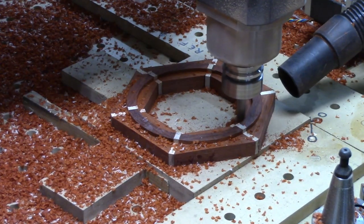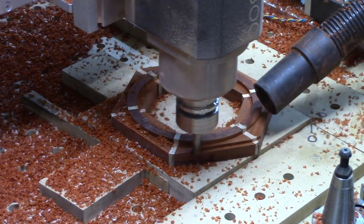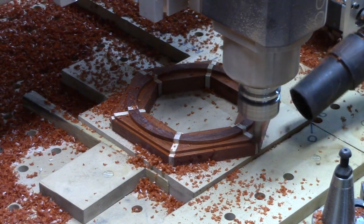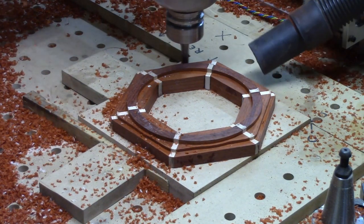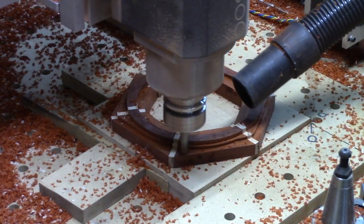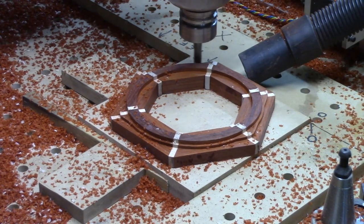When I first got the CNC router, I actually built a fairly serious dust collection system for it. And after using it for a while, I came to the conclusion that it really wasn't worth the effort. I do such a variety of odd-shaped pieces, I was always running into trouble where the dust collector didn't work, didn't fit, got in the way, reduced visibility. I think a lot of woodworkers that do more uniform stuff, more like panel stuff, probably have better results with dust collection. But for me, I finally took it off because it really was more of an impediment than a useful tool.